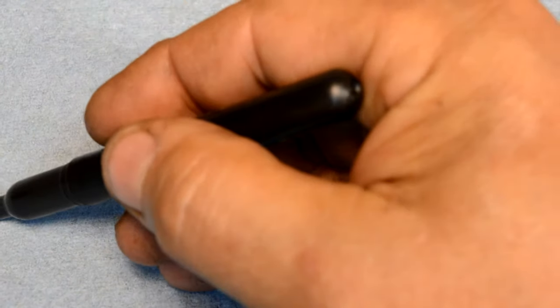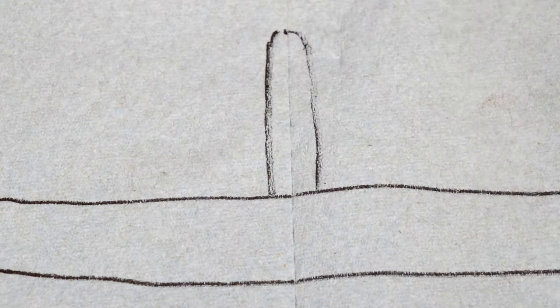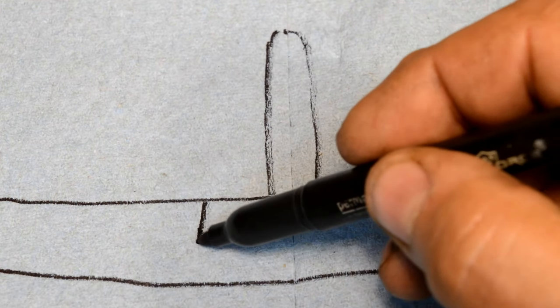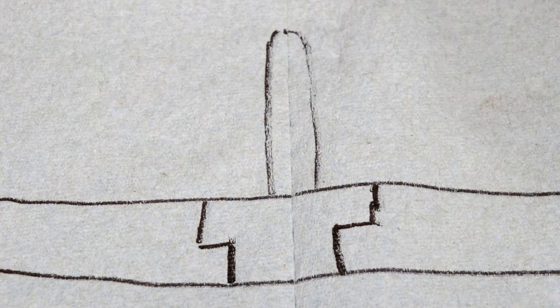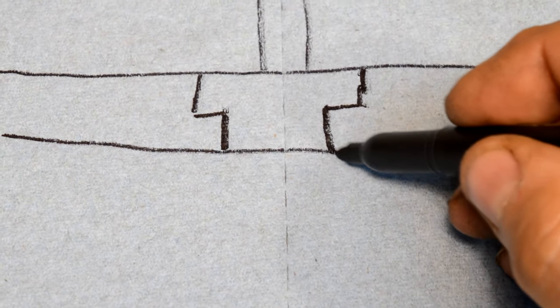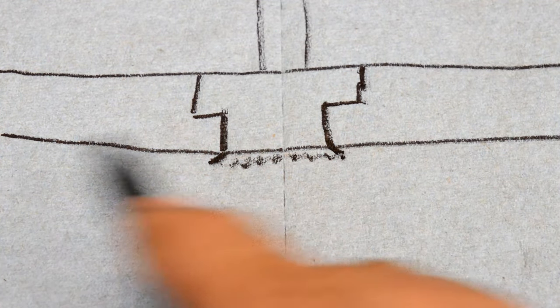To the best of my knowledge, here's the sidewall of the frame. We're looking down from above at the sidewall of the frame here. Let me pull this up a little bit. All right, and we need a pin. The pin sticks up like this, and then the trigger is gonna ride in this position right here, and it's gonna ride that way. So if I'm right, this pin actually kinda looks like this. And then it's got a stud sticking out there. And the excess material was kind of rounded out like this and peened out and then ground over. And that was ground over down flat. And then the whole thing is polished.